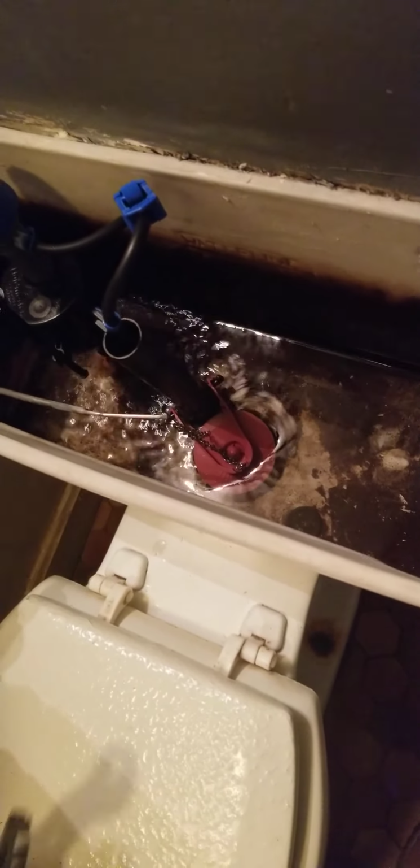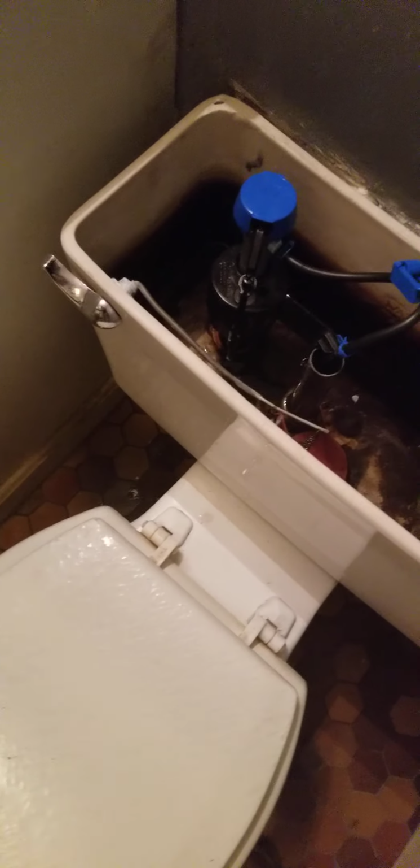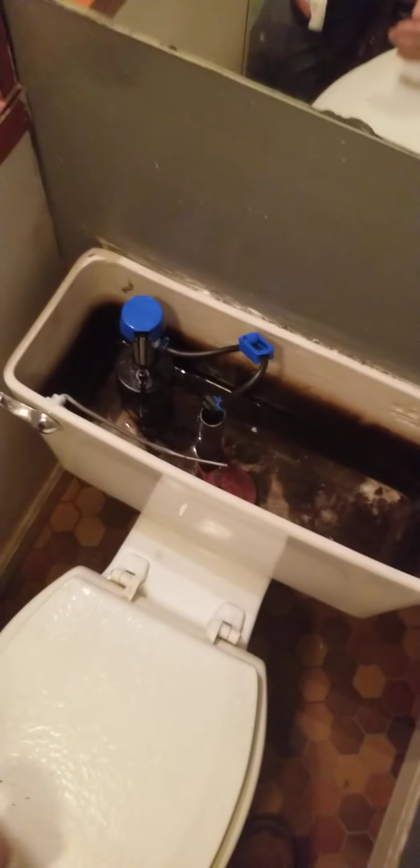Now right now, underneath here, I'm noticing when I turn the water on, this always happens with these valves. Once I turn it on, this nut right here, it's leaking from it. You can see it dripping. I'm going to take a wrench and we're just going to, again, righty-tighty that. Bring it up. That should solve that leak. It's been so old, so long since it's been touched. Sometimes you just got to crank that pack nut right back down, just like that, and it stops the leak. So be aware of that. That happens a lot when you haven't touched a fill valve in a long time, chances are very good it's going to leak on you like that. So we'll let the toilet fill and we'll get right back.